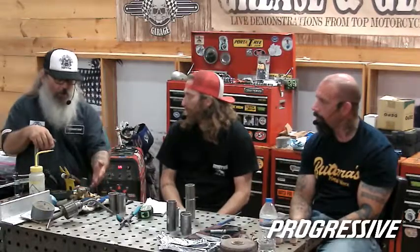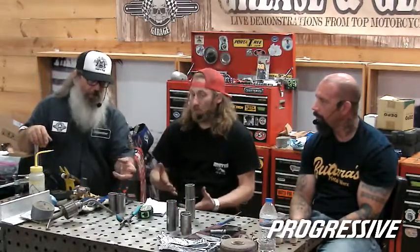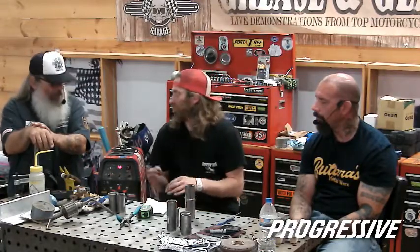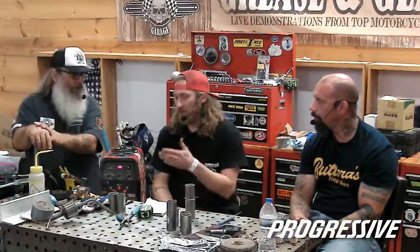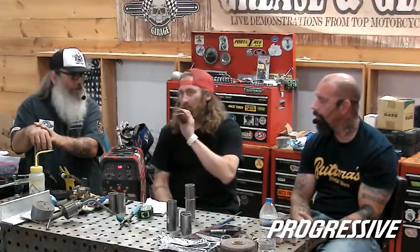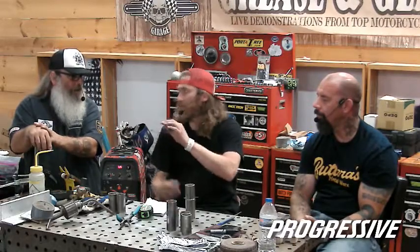And the big difference, like a lot of people have two different thicknesses of metal. Is it easier to weld thicker than thin? It is in the beginning, if you're welding mild steel or aluminum, because there's a lot of play there. You can pour a lot of heat into it and learn. But with the thin stuff, the pulse plays into it as far as keeping the heat out of the part. That allows the part to solidify between each dab. So you're putting the right amount of heat into that one dab, and it's allowing it to solidify for a second as you move. Instead of keeping a steady amperage, you'll see on your heat affected zone, it'll taper up and get wider. Right. So it helps to keep it consistent that way too.